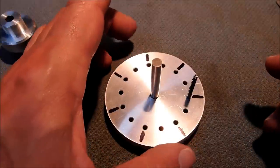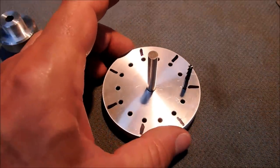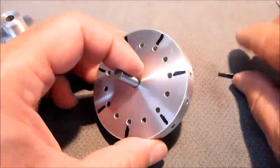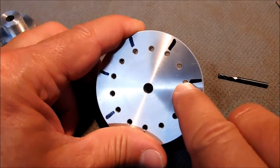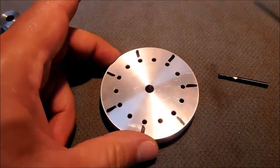Don't get caught up in that thinking you can't make a precision fixture because you don't have a digital readout. That's not true. Gonna take you over to the mill. We're gonna punch a 250 hole in the backing plate. We're gonna pop a little slot at, let's say 30 thou on either side of the 1 inch because this is a 2 inch center.